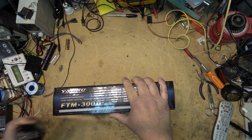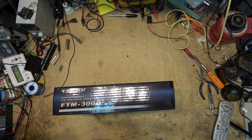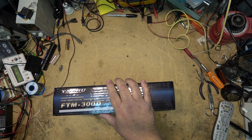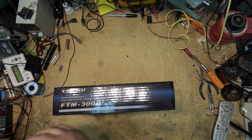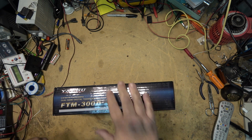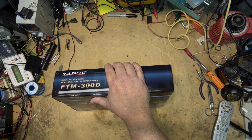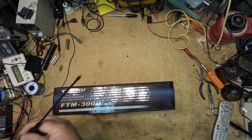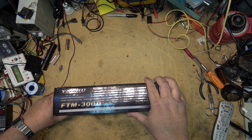And hooking up an external antenna to this is a pain in the butt because you've got a heavy coaxial cable connected to the top of the radio. But again, they're not very powerful, so I decided on a little more power. And Fusion seems to be the future. The DMRs are kind of a pain to work with. Anybody who's dealt with DMR knows all about that. You've got to put it in channels and slots, and there are different tiers of service. Some radios are tier 1, some are tier 2, and they won't communicate with each other. So yeah, this one here, I got that. This one's junk. It's a Baofeng, but it does the job, though it's not really a great unit. They're cheap though.